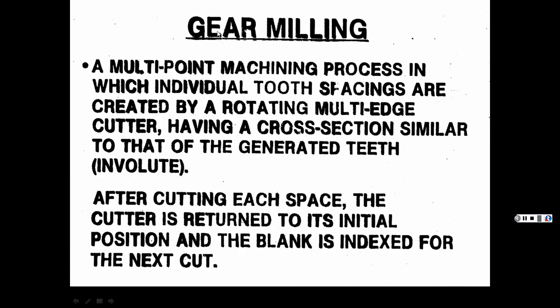Okay, so this is just regular gear milling. That means you just have a regular standard milling machine. You don't have these specialty machines, which we'll talk about, gear hobbers and gear shapers. Special machines, that's all they do. A milling machine can mill out different surfaces, get something flat. It can machine anything where you're making square rectangular objects and cut out pockets inside them and stuff like that. It can also drill holes if it had to and do all kinds of stuff.